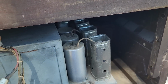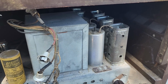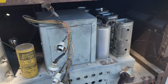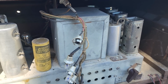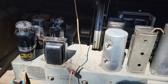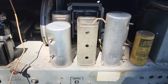It's the thyratron, which we should check and see if it's radioactive. Apparently some of them aren't. Some of them are gas filled. Some of them are gas filled with a tickler in them because they're like a relay. They conduct. They're not a linear amplifier type thing. So very interesting. Needs very much restoration. Needs love and TLC from somebody.